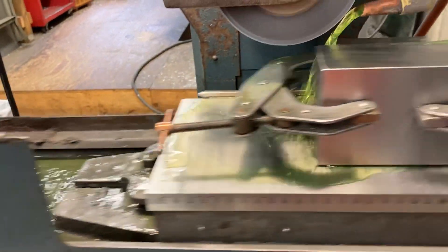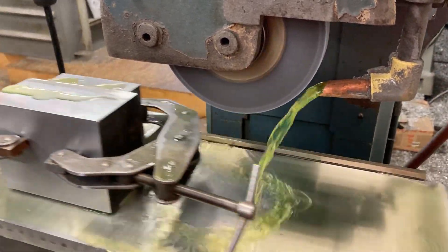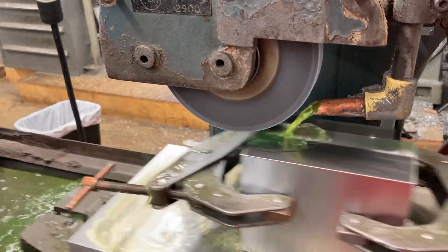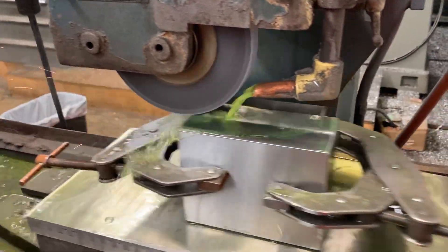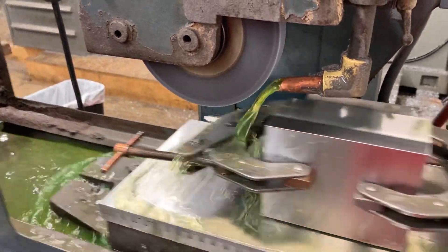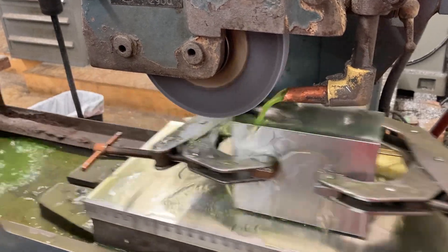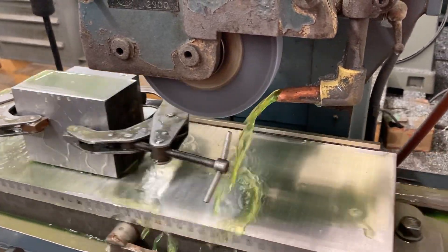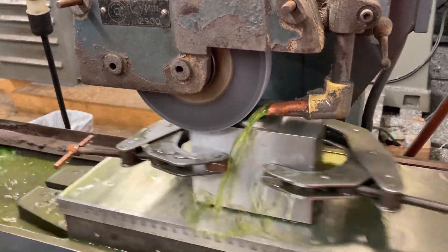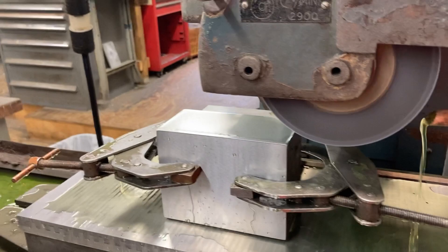We'll make a little sparkage here. Coolant on, come down one thousandth of an inch. Before I rough milled this block on the mill machine, I checked and squared the head to make sure it was pretty square so those surfaces wouldn't be out of whack. That was within one thousandth — the head is pretty square because it didn't even take a thousandth to clean that surface.